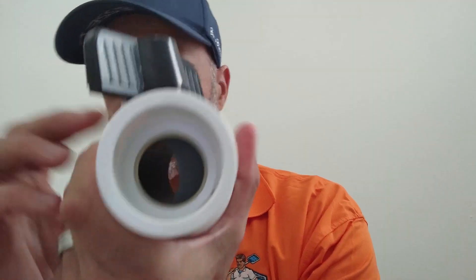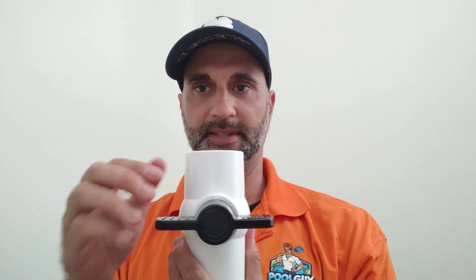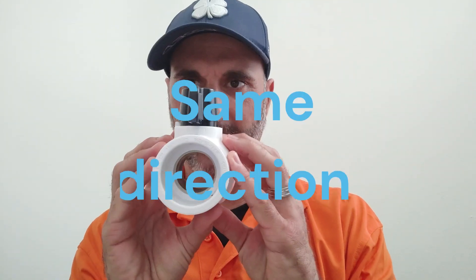You're still getting flow going through the water — you're not completely closing the water line off, just a little bit of water coming in. If you want to reduce or expand the flow, it's wide open now. Close it a little bit and you get a little bit less water coming in, still coming through a little bit, not much, and then completely closed when it's the opposite. So a ball valve — handle going in the same direction, it's completely open.